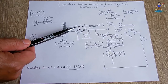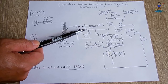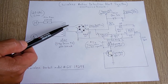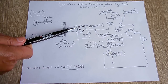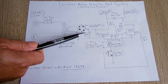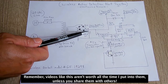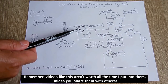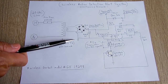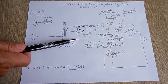The diodes are connected anode-cathode, anode-cathode, anode-cathode, anode-cathode. This line right here is going to be the white line on the diode. The purpose of this is to convert the alternating current into direct current. So over here is going to be your negative, and over here is going to be the positive. You're going to take that output and take a capacitor just to smooth out the ripples — a 470 microfarad 16-volt, positive to positive, negative to negative. The ground symbol throughout the circuit just means you want to tie it to the negative line right here.